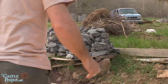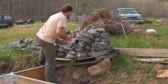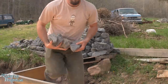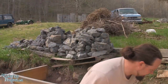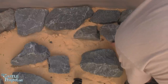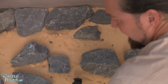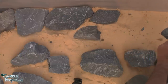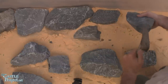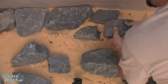Time to go back to the pile. There's nothing magical about picking the next piece to go in — if it fits, it goes. And there's an old rule in masonry: if you lift it, you put it in the wall. The only sorting I've done for color was pulling out colors I didn't want to use. I found one that's going to bridge these pretty well, but they both need a little dressing. I'm going to take this one back and knock this point off. I am going to get some stone chisels — there are a couple companies that make some that I love, but all in time.